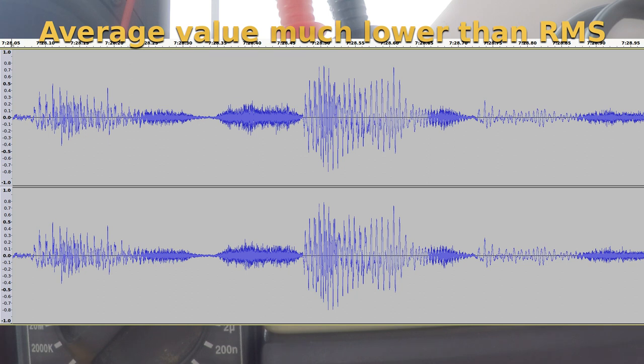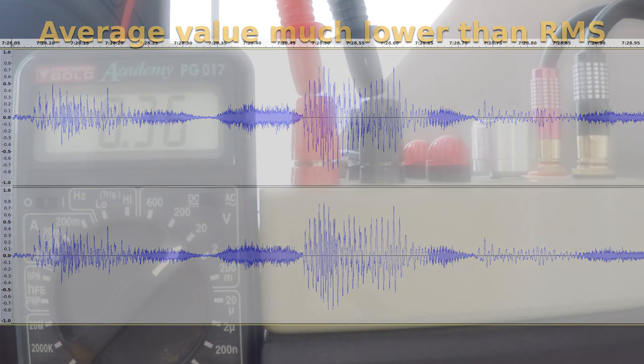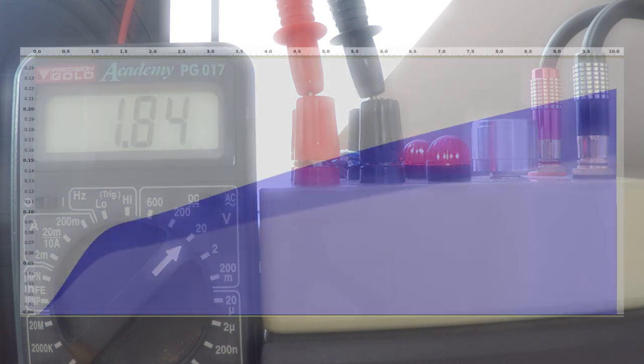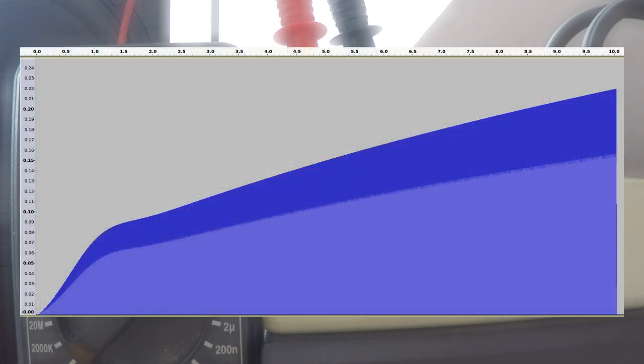Unfortunately, due to being in the middle of a move, I can only test the compressor through my audio interface, Audacity, and 45-year-old amplifier. Fortunately, these clandestine means are just enough to demonstrate the compressor's behaviour. A quick test with a rising amplitude 1 kHz sine wave from 0 to 7 volts RMS over 10 seconds shows the input to output level characteristic of the compressor.